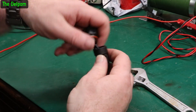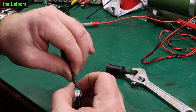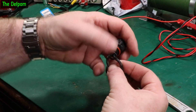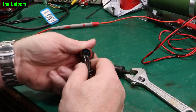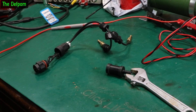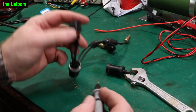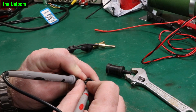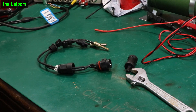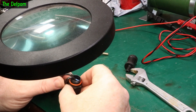So there we have a resistor - what size is that resistor? The cable gland's kind of binding, but that's all right, even though it looks like they've been digging in quite a bit. Can't see the resistor colour clearly - is it green, black, black or something? Let's measure it, just for reference sake in case it ever fails - it's across the top two pins. 200k. So it's red, black, black then - red, black, black, orange, brown.